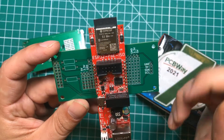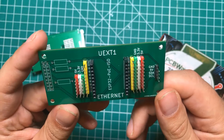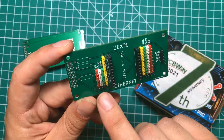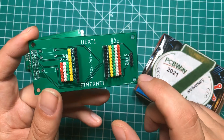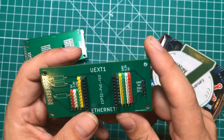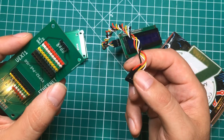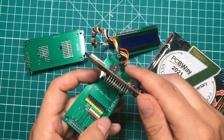You can set this thing up to prototype however you want. In full prototyping mode, I set up a set of female headers to mount the board, usually just one row of extra pins in case I need to tap into a pin, and then ground, 3.3 volts, and 5 volts on both sides. My favorite way to use the I2C connector is with the 1602 LCD screens using pre-made DuPont connectors from Amazon — it's a little weird to have red as ground but that's just how it goes.